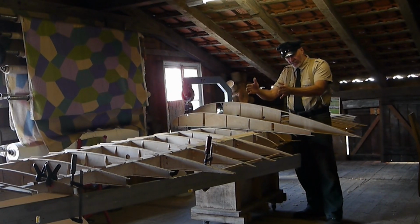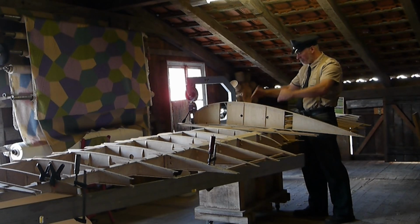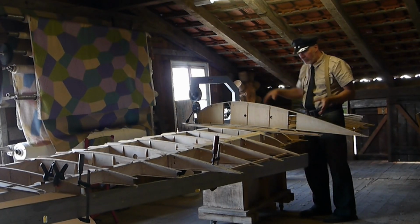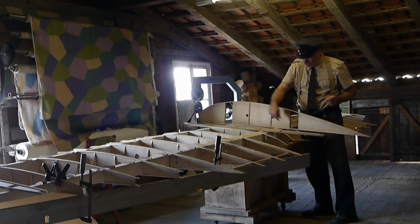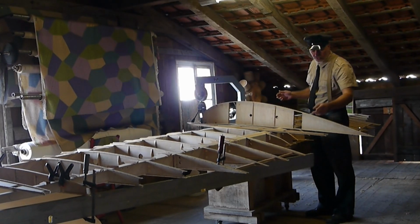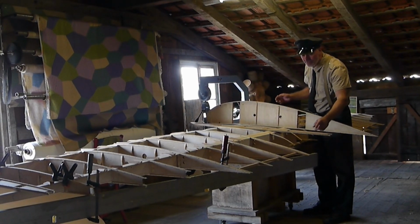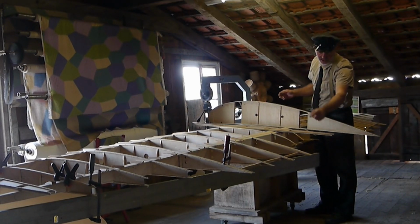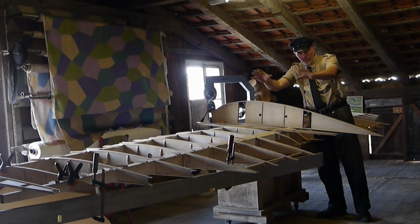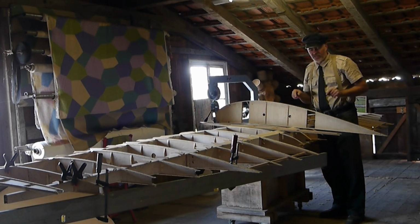He could simply put his spars, which were massive, on trestles or straight tables like I do here, and make sure they are not twisted against each other. They were rigid enough to remain straight, even over the entire wingspan length. They remain straight and untwisted compared to each other to the wingtip. And when the ribs are pulled onto such a system and the undercamber of the airfoil is the same all the way to the wingtip, all I have to do is put a straight line underneath them and the entire geometry of the wing provides itself.